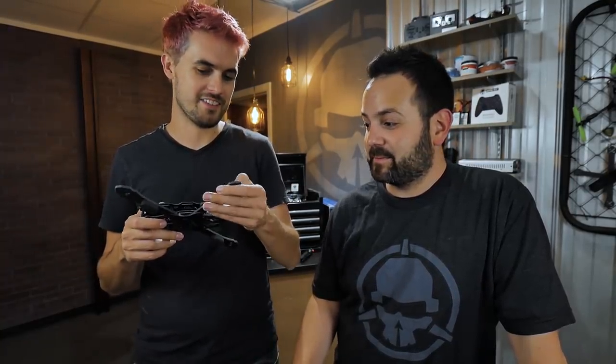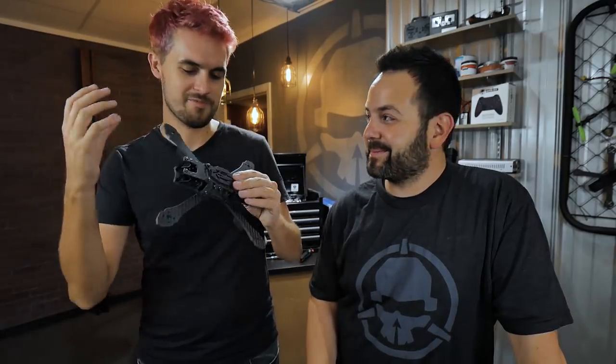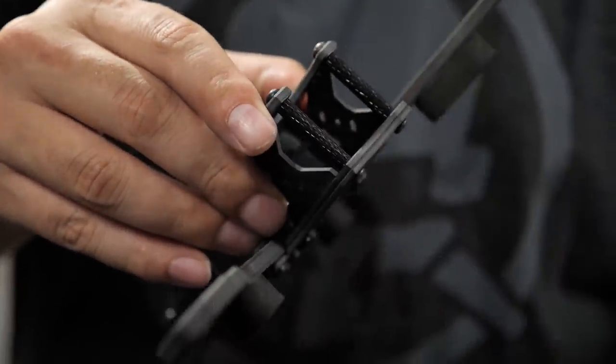They used to always have slots so you could do 16x19, but more and more motors are 16x16. All of our Hype Train motors are 16x16, and it's nice because it makes the arm end more durable with less material removed. I like that it's got this split bottom plate design - I think that's going to make it a little bit stronger. It sandwiches the arms without there having to be an additional dedicated sandwich piece. A lot of frames have the arms meet in the middle with a bottom plate and a small sandwich piece, but this has two bottom plates that overlap.